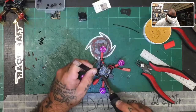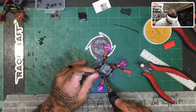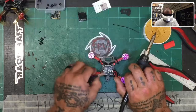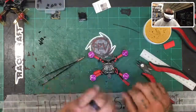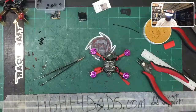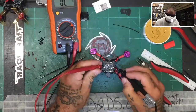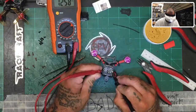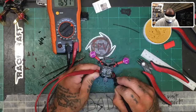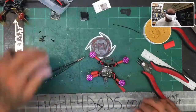At least you guys get to see that mistakes happen — you're not the only ones. Most people will edit this kind of thing out, but I don't. So now I've put it back on correctly. To verify: if you've never blown a capacitor before, it basically shoots out and it's not pleasant — it will scare the crap out of you. So once corrected, I'm checking continuity — ground to ground, there's continuity. Positive to positive, there's continuity. Ground is not touching positive, and positive is not touching ground. Perfect.